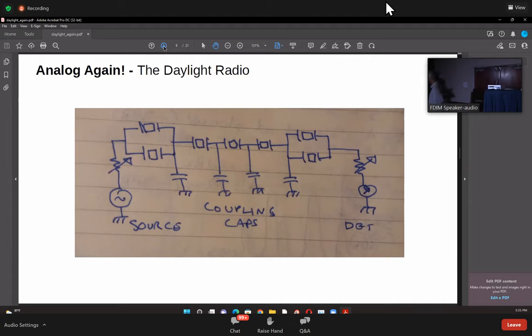So here, when we say characteristic impedance, we are saying the characteristic impedance that's required to drive and load a crystal filter to get the bandwidth that you want. There is no characteristic impedance for a filter, regardless of the bandwidth or the shape. So you want this shape, you want this skirt, you want this central frequency, then that's the impedance that you have to drive it with, and that's the impedance that you have to terminate it with, okay? Next slide, please.